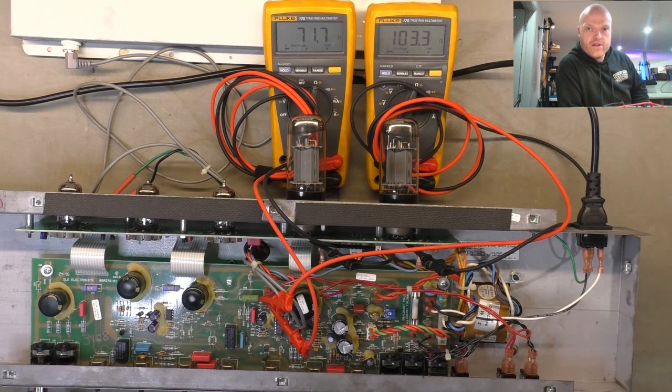primary impedance is correct. And as far as AC and DC are concerned, DC just sees the length of wire. AC sees a bunch of coils. If it was way out, like one was like 10% of the other, we'd probably have a fault or shorted turns or something dramatic.